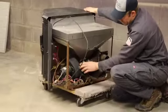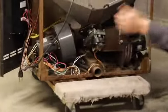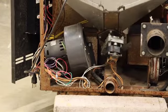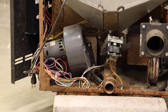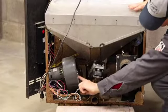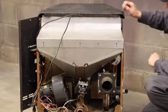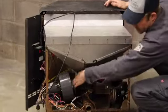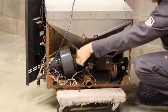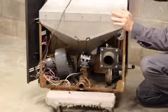The next blower is the convection blower, or the room air blower, and it blows air over the heat exchanger and into the room. The way these heat the house is: room air comes in the back, goes all through this compartment, gets sucked into this opening right here, then gets pressurized and pushed out the front air grill. We need to reach in there and make sure there's no debris — look, there's some lint in here — just suck that out and clean it. That's the convection room air blower.